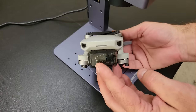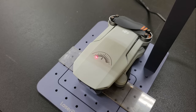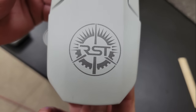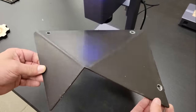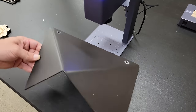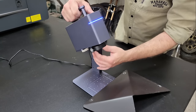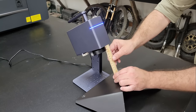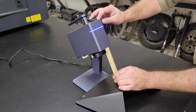After confirming that it can engrave bright plastic, I then engraved my logo on the drone itself. Just engraving at an angle, I engraved logos onto the painted aluminum air intake ports for the homemade electric buggy that I made last year. This is a really convenient feature, but the angle of your workpiece needs to match perfectly with the angle of the module, otherwise the focal point will be off from one side or the other, and the engraving depth and color won't be consistent.